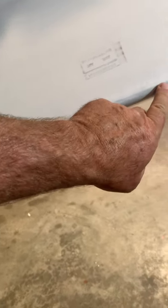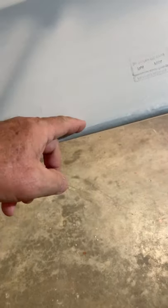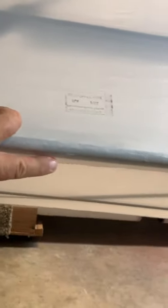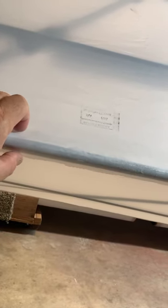Then roll it over like this. You're going to glue just this edge to start — don't get a lot of glue up here and don't let it stick to the tube back there; you only want it to stick to this part of the tube. Just put a little along this edge for now to hold it in place. Then you'll cut about an inch and come back and glue this to the bottom so your seam is on the bottom. Take your time and make a nice cut — even though there'll be tape over this, the seam will still show through just a little bit.